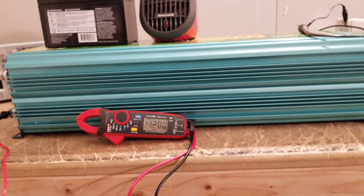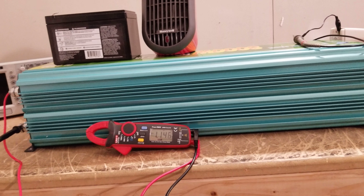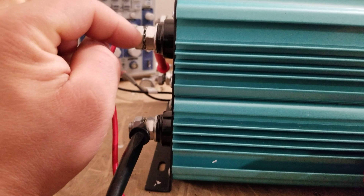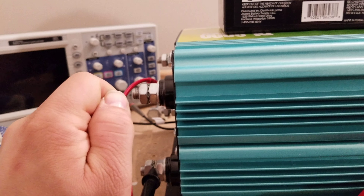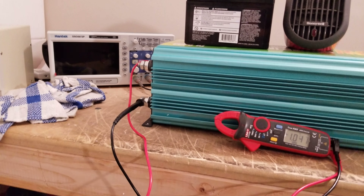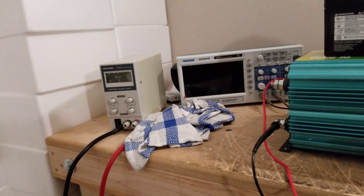That's something to be aware of when you're connecting your battery bank for the first time. It produces a very scary and very large spark — it almost welds your battery cable to the terminals. You'll always see, especially on the big inverters, a big black scorch mark on the corner there where they were first touched. It's definitely scary at first.